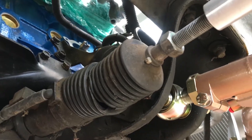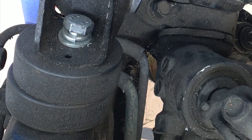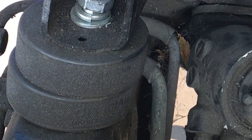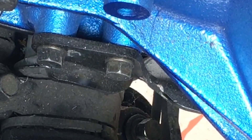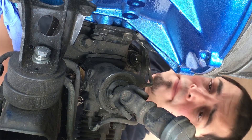The passenger side boot is ripped into three different pieces and there's just dirt and spider webs everywhere. From this angle there are a few things that are wrong with this hockey puck setup. The obvious ones are: the bolt holding the motor to the front subframe isn't fully seated up against the engine mount — even though the nut on the other end is very tight, the lock washer isn't even compressed so it's not locking anything into place. The hockey pucks are offset even though both were clamped and drilled as a set. Finally, this bracket here is the one that was hitting the steering rack. All of these problems will be fixed by making the solid motor mounts.